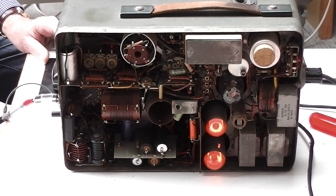Therefore, the two stabilizers are limiting the high tension to about 305 to 310 volts, and that's performing well. At the moment we switch on the transmitter, the voltage drops to about 235 or 245 volts, and that is far too low for igniting the two stabilizers.